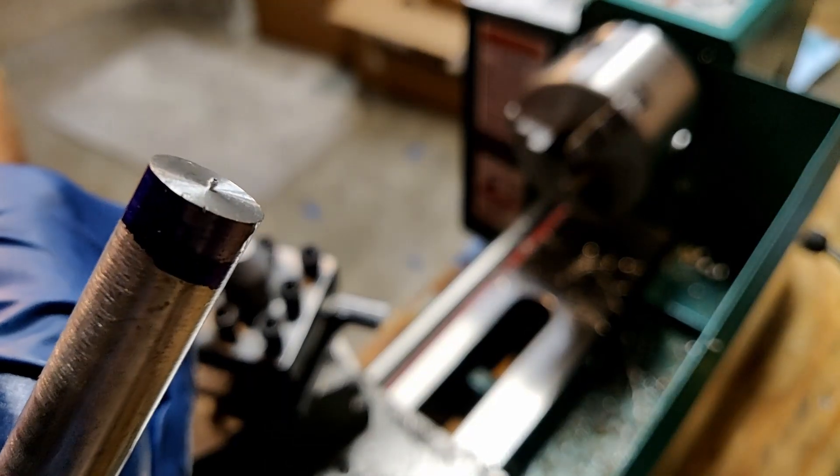As I'm trying to make sure this is indexed properly, I actually do bump the lathe — which is exactly why I need to get this bolted down. This alone will improve most of the surface finish issues that I'm having. I've adjusted the tool to interact with the live center in a way that won't damage the live center or the tool, and I'm ready to take some longer cuts under power feed. None of these cuts are more than about 10 to 30 thousandths of an inch at a time, but I'm still getting surface finish issues due to rigidity problems. I try to improve the surface finish by using WD-40 as the cutting fluid but unfortunately it doesn't do much better.